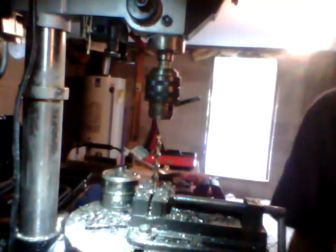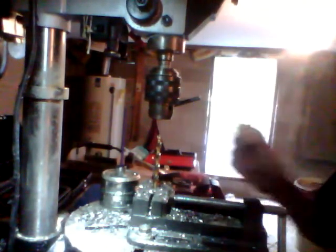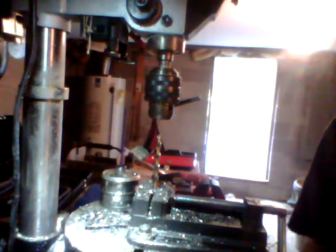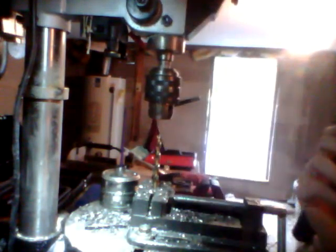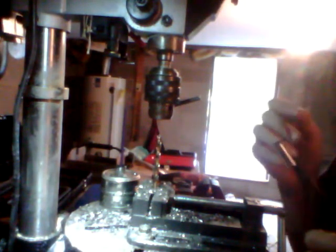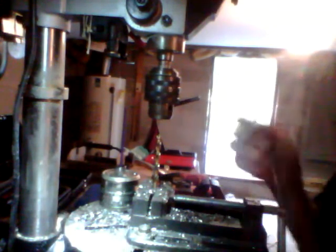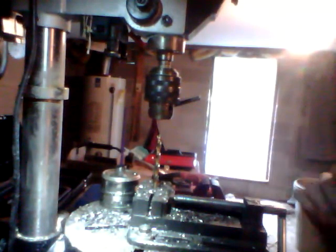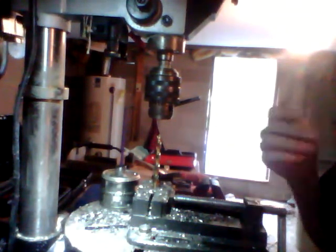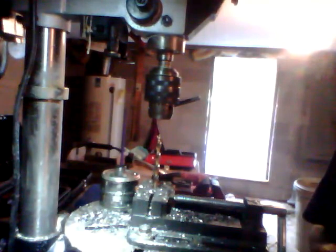As you can see, that's actually pretty good for not having a lathe and doing it on a drill press. It'd be really hard to get that good of results doing it the opposite way, which is what most people would probably do. It's a little off, probably because the end here wasn't flush — I didn't take the time to file it down, make sure it was flat and square. But if it was completely flat, it should be perfect every single time.